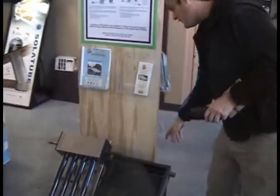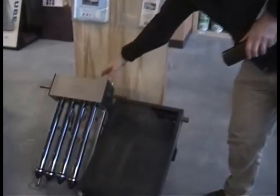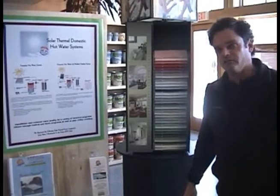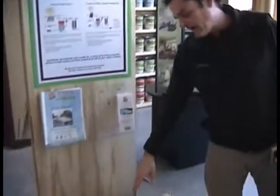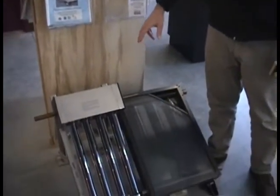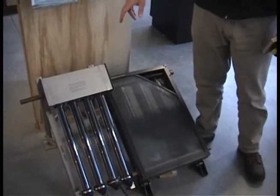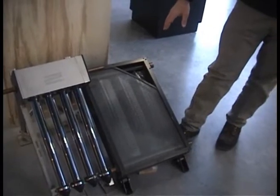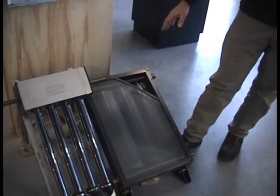We're looking at two different solar thermal collectors. One is a flat plate collector and the other is an evacuated tube collector. The reason I carry both collectors is because they fit and serve two different needs. The evacuated tube collector is what I refer to as my northern climate collector, and my flat plate collector works really well in warm and hot climates.